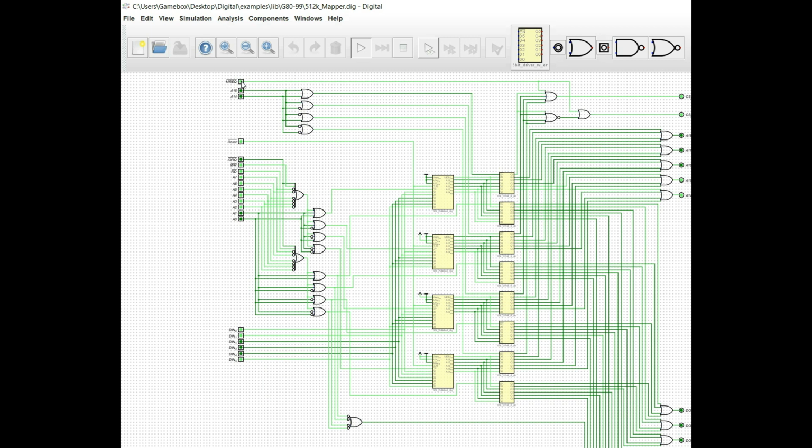So as you can see, the RAM chip select goes low. And if we reset this, it'll flip this bit up to the ROM chip select, and then it'll zero these out. And I can prove that just by doing this. There we go.